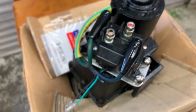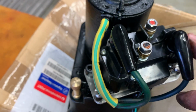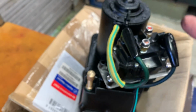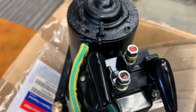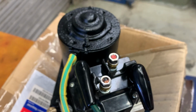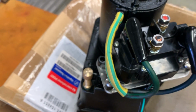is what I'm using to actually switch it. This is a Chinese winch switch. So it's a switch that you would use to switch power, because obviously this is a very high amperage motor. It's direct drive to the pump, so it would draw a fair bit of power. So all I need to do to this now, I've got these connected up, and it's pretty clear in the instructions that you get with these. I think these are $27.